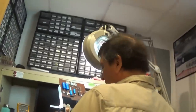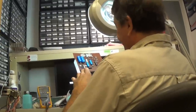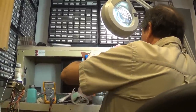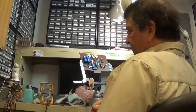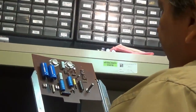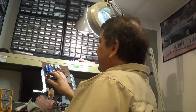Transistors on here, but I don't think getting into that is necessary as a maintenance item. Sound cards generally have failures at the capacitor. Generally, or that's the only failure they ever have? Yeah, and if they don't work, then there could be a component issue, but I heard somewhere that all you have to do to fix anything is replace the caps. I don't know where I heard that. In an audio device, it's where you start. It's not going to fix it if it's broke. It's a maintenance issue. It's a deterioration failure.